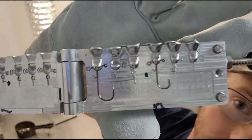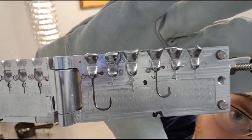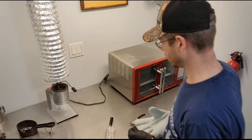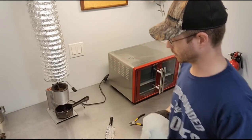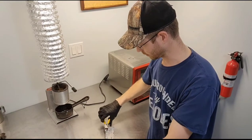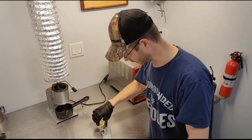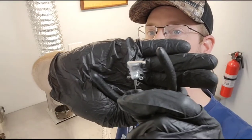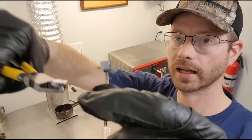They all stuck to the other side. I poured the other ones just to help heat the mold up, but I poured them kind of fast and this thing is dribbling a little bit — it's not pouring the greatest. I probably need to clean my lead pot out, lubricate everything, maybe use some anti-seize on the spout to help it pour better. Never throw these back into the lead pot — throw them down here, because if you chuck them in there they splash lead all over the place, which can be dangerous. I'll take my flush cutter and just clip that straight across, because we want that hatchet head to be sharp.